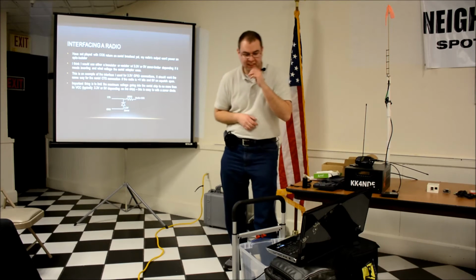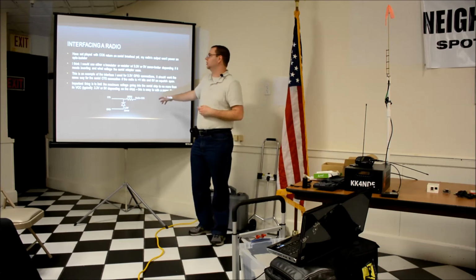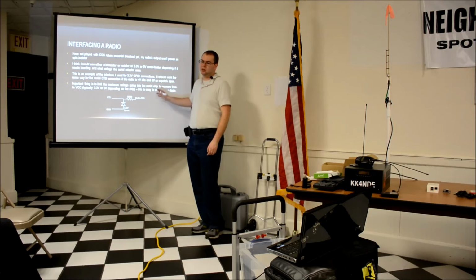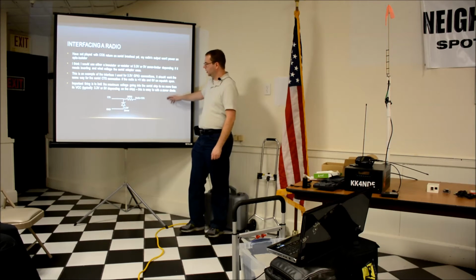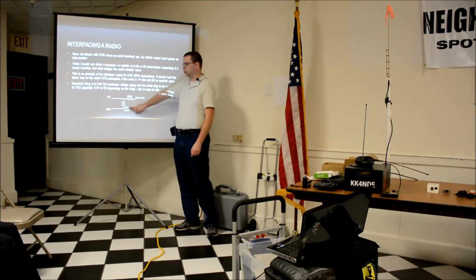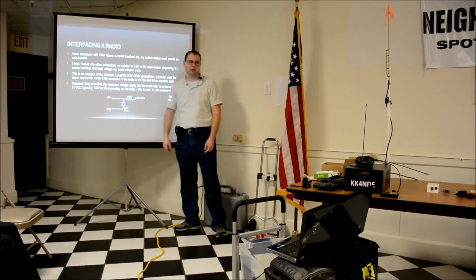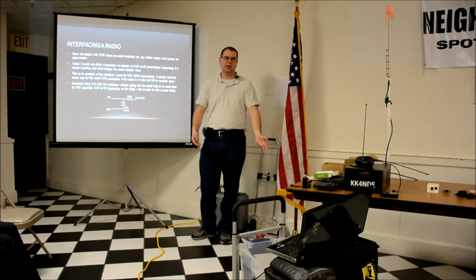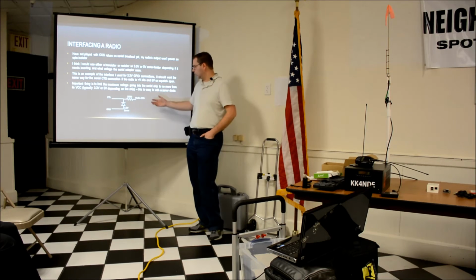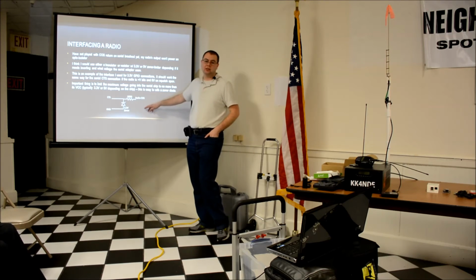While I didn't do the carrier-operated squelch on the digipeater, I did do that for the Echolink Node, and I believe it works the same way on the serial interface board as it does on the GPIO. In my case, the radio, I believe, went low when a signal was detected and sat there at 5 volts. It was a 5 volt or 0 volt signal. So I just ran it through a resistor and have a 3.3 volt Zener diode to make sure it's compatible with the 3.3 volt levels on the serial chip and the Raspberry Pi, and it keeps everything happy. It didn't seem to need any more complicated isolation than that. That seemed perfectly adequate. I didn't have the ground path shared because it was already shared.